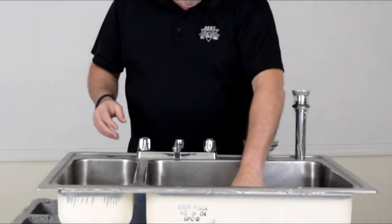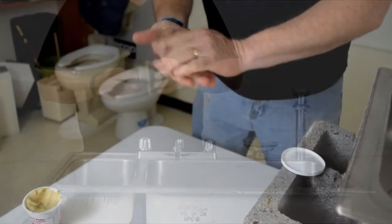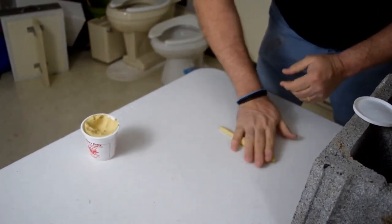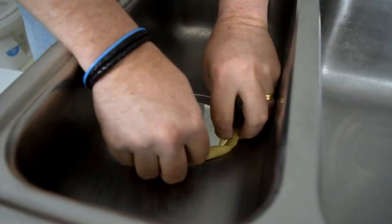At this point you've cleaned the rim of the sink and you just drop it in. Without this, what you'd be doing is taking about a golf-ball-sized piece of putty, rolling it out until you get it to about that diameter. Some people put it around the opening in the sink.